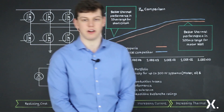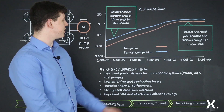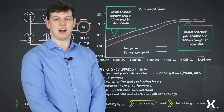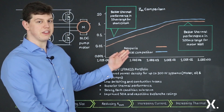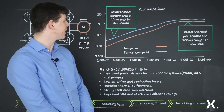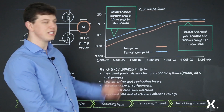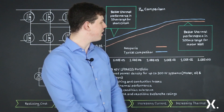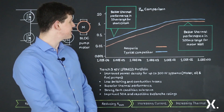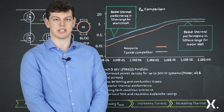Another benefit of the portfolio is strong fault condition tolerance, as shown in this thermal impedance comparison. This graph shows Nexperia versus a typical competitor in a Power33 package of a similar RDS-ON performance. The lower the Z-Theta, the better the device is able to dissipate heat away from within the package. Looking at the two fault conditions — short circuit in the 10 microsecond range and motor stall in the 100 millisecond range — one can see that Nexperia has a lower Z-Theta and is thus able to dissipate heat better, meaning it has a stronger tolerance towards these conditions.